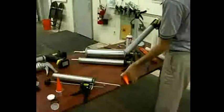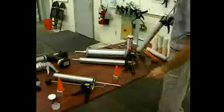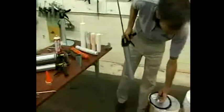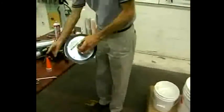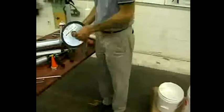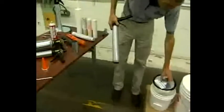The third most popular way to load bulk caulk is with a follow plate. These handy accessories fit snugly inside 2-gallon or 5-gallon pails. There's a threaded ring in the center to accept an Albion 2-inch diameter bulk gun such as the DL-45 or DL-59 series. It's cleaner than using a loading sleeve and has the added advantage of keeping air and other contaminants out of your pail of caulking.